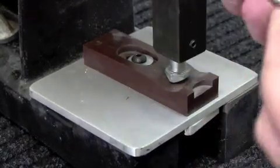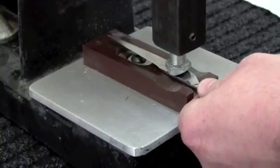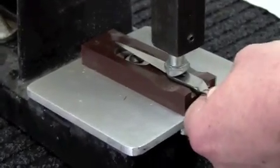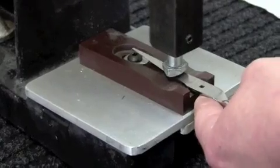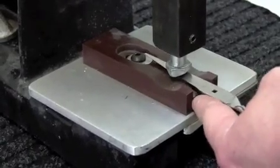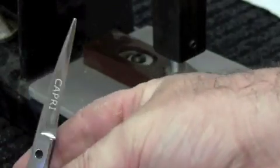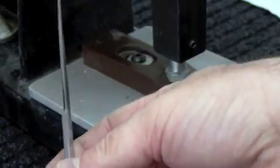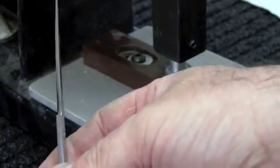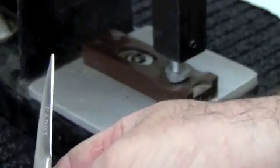There is still a little bit of a bend right in this area of the blade. When I lift this away, what I'm doing is just checking the overall bow visually. I'm going to start back behind where that area is again and try to put a little bit more of a gentle curve right into that area, and we'll see if that fixed it or not. The blade is definitely bowing back the direction that it should, so we're at a good stopping point. I'm going to go ahead and put this together and do a quick test cut.